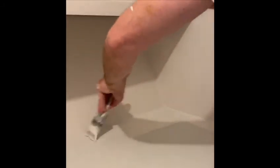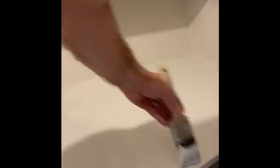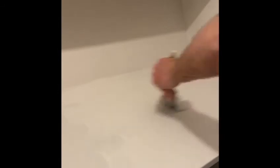Get the paint on in one direction. Now if you feel it's a bit too built up in some areas and it's not going on very smoothly, you can do what I think some people call cross-hatching. You go 90 degrees, not pressing quite so hard, quick movements like that, and that disperses the paint more evenly — then you go back the original way, getting lighter with your pressure all the time. Keep your movements going to maintain that wet edge. If the phone rings or whatever, ignore it — because as soon as you stop, the paint starts drying, goes sticky and you can't work with it. If your paint is going off more quickly than you can cover the area, just put a little nip of water in it, particularly on your final coat — just loosen it up and give yourself a little bit more time.